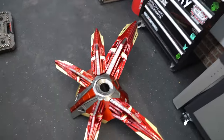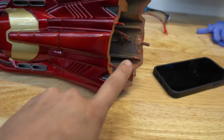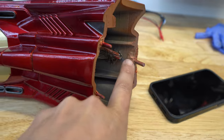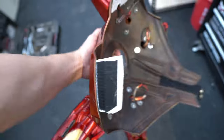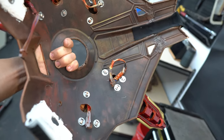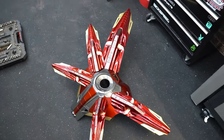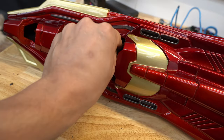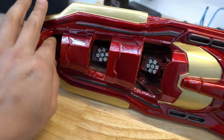Okay, we are now in the process of attaching the spikes to the back. The clear coat's dried enough — it's good enough. What I never showed when I was actually building this thing was how I was attaching the spikes. I took some screws and buried and melted them into the part. There are bolt heads and nuts at the ends of them so they don't twist. In each spike there are three attachment points, and I'm using some washers to hold them into place so they don't fall out. This way I can also break it down to travel with it because this is going to need to fit in a suitcase. I'm going to get the last bit of the spikes in, peel off the tape that's been covering the NeoPixels for like the past year honestly, and we'll get this thing wired up and test fire it.